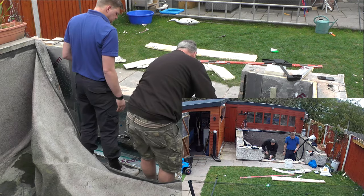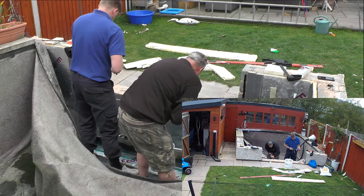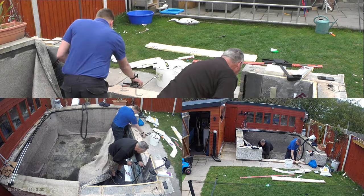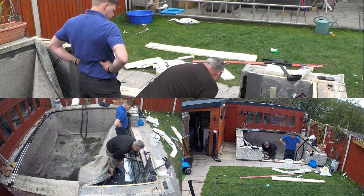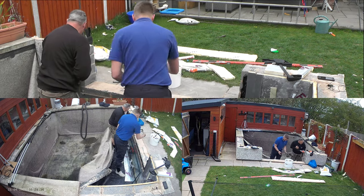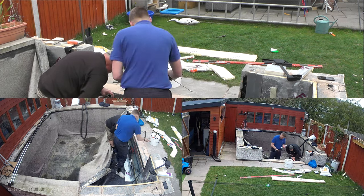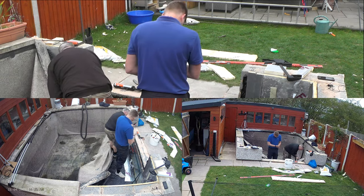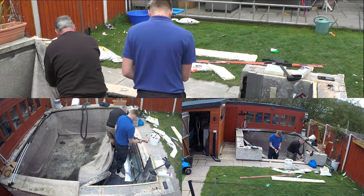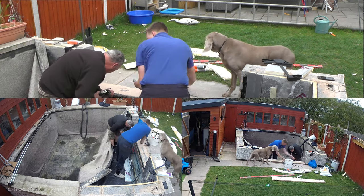As I was panicking about getting enough sealant in, I opened up about 6 tubes and prepped them all ready and started sealing around the frame with a very, very thick bead, probably 10-15mm wide, about 10-20mm deep. And then I started a second bead along the side of that. Then went to the other side and along the bottom, all ready for the lift, and then realised that we'd not cleaned the glass first.